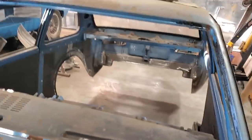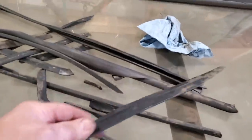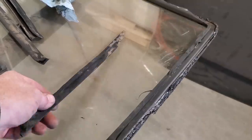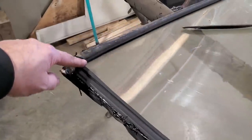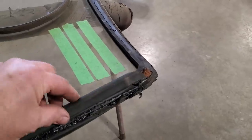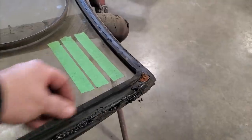I hauled the windshield out of it. All I did is I actually cut the rubber. As you know, I had to go look for a rubber online. You guys pointed me in the right direction, and I found window rubbers, because I knew this was going to be very hard to get out. And all I did is cut the inside lip right here on the rubber and just pushed the window out to the inside, because the rubber went along here like so, that held it on the pinch weld flange, and I just cut that off